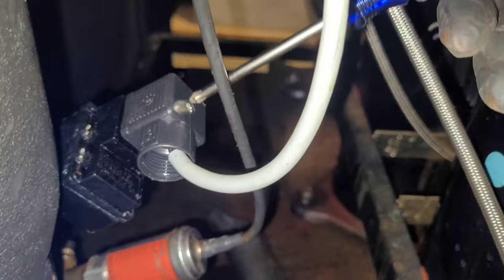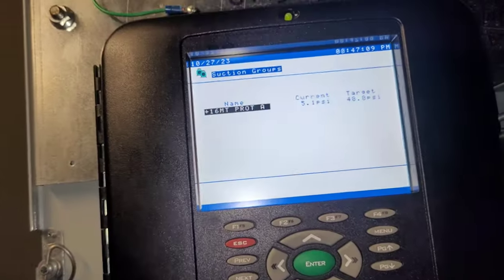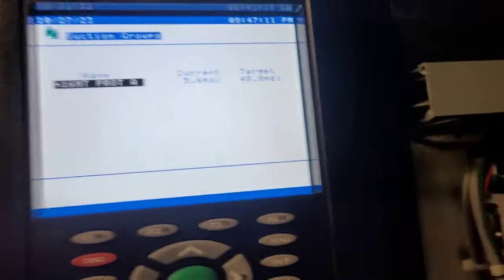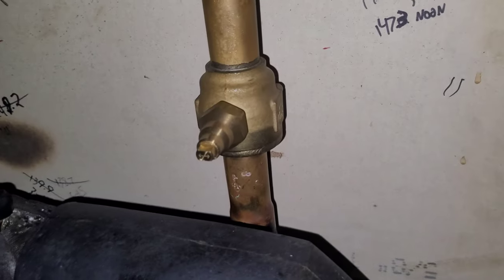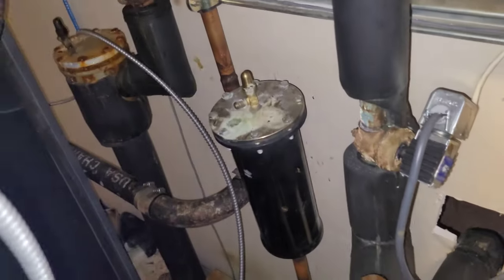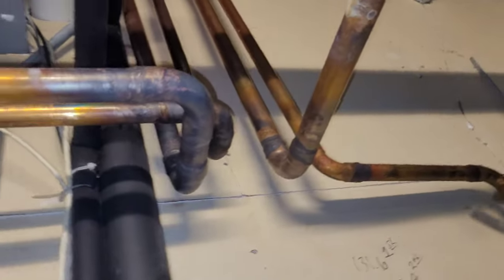These harnesses are held by a center screw. Here I'm in the middle of the pump down. I have the liquid line valve off, which must be done downstream of the receiver. If you follow the flow you can determine that this is the right location on the liquid line. The receiver and condenser are on the roof.